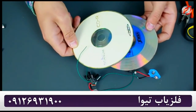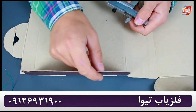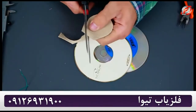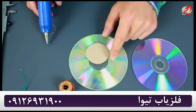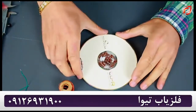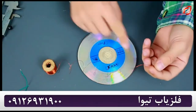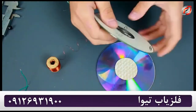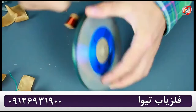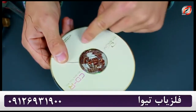We're going to need two compact discs and a 1–2mm thick sheet of cardboard. First of all, we need to cut out a circle 50mm in diameter. Then we need to glue one compact disc to one side of the cardboard circle and the other disc to the other side. Now let us wrap a 0.2mm copper wire around our discs. Here's the coil we need to end up with — in total, you'll need to wrap it 350 times.